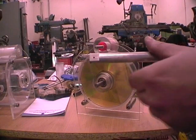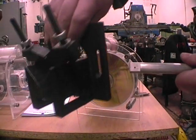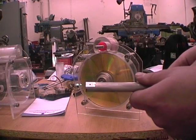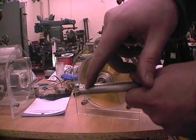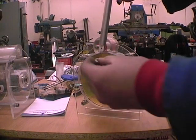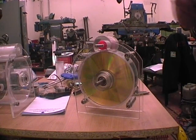Cut a flat — actually, you don't even need to cut a flat. Then put it in the Keats angle plate, in the drill press. Drill it 5mm and then tap it 6mm to take this fitting. Then it'll simply go in there and use a nut — effectively a lock nut — to lock it onto the air injector.